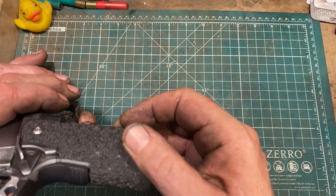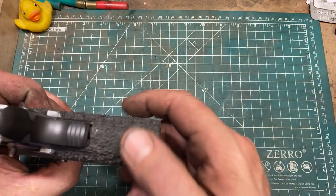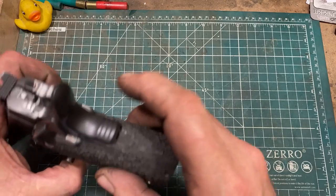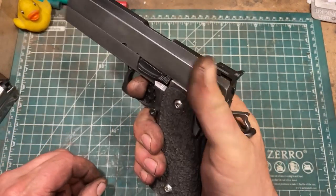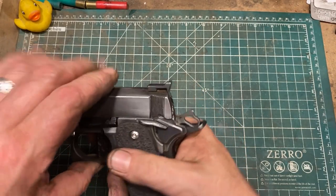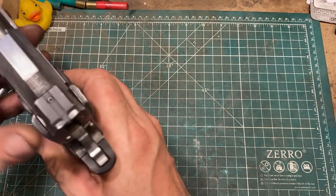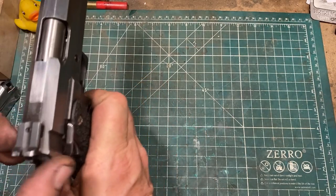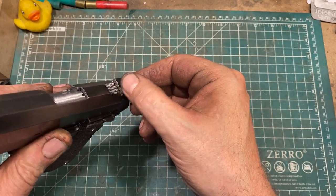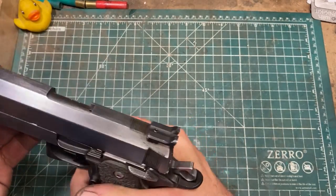I carried the texturing all the way around the grip frame over the polymer mainspring housing that came with the module. I put a heavier mainspring in because the one that came with the grip module was not reliably igniting primers. The grip safety is deactivated because this mainspring housing holds it in too far for it to function — I don't care. This slide had no serrations whatsoever, so I cut these serrations here, cut in very deep at the front so that they slope to the rear, providing an extremely secure grip — I call it a charging handle. I also did 30-line-per-inch serrations on the front of the slide so that if you have to rack it against a belt, clothing, or whatever, it will work much better.